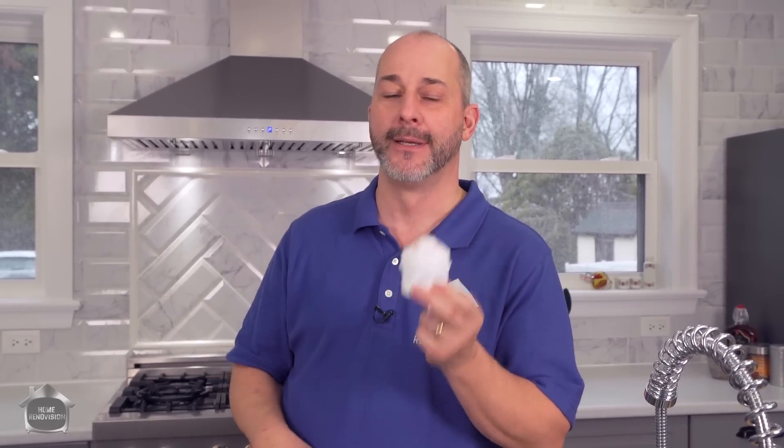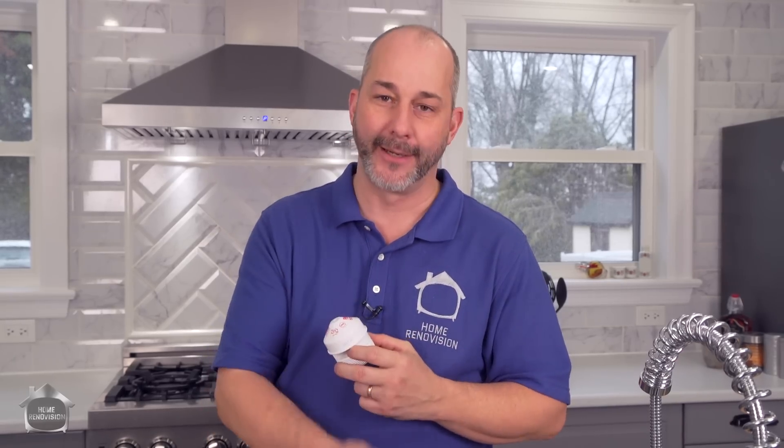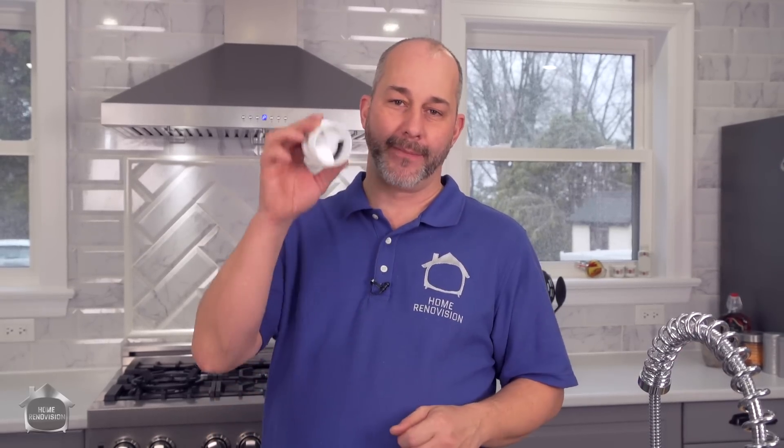Here's a little trick: if you don't have access to fresh air from outside for your venting system, you can create a venting system inside the house as long as you have it high enough and you have access to it so that you can change it. Because sooner or later something like this is going to malfunction — you'll know because your sink will start making funny noises again. If that happens, open up the vent, swap one of these out. They're about 30 bucks where I live, and that problem is solved.